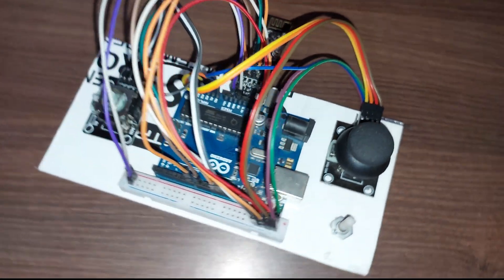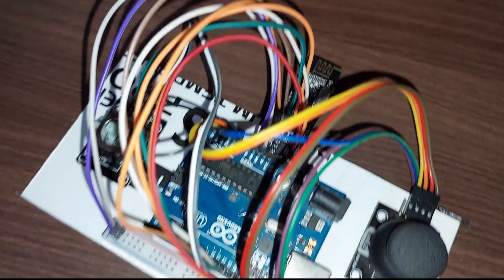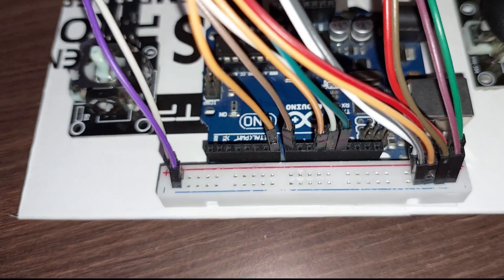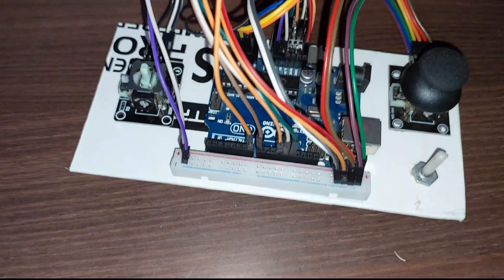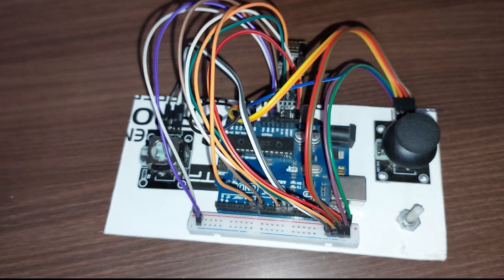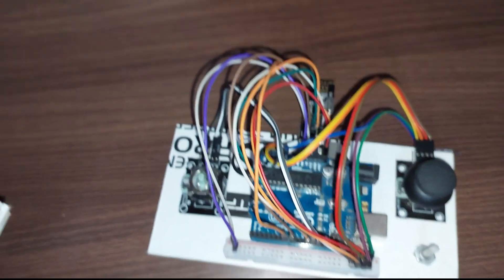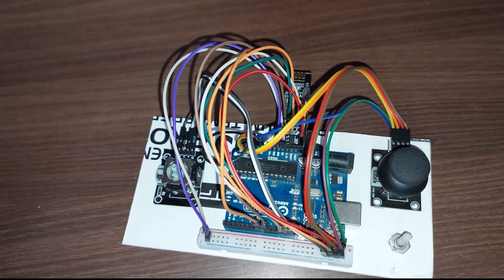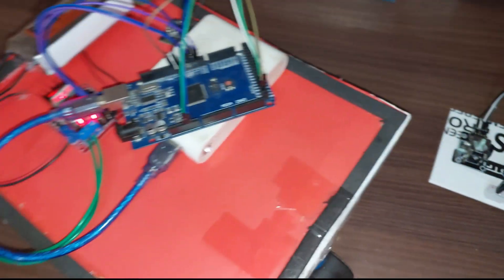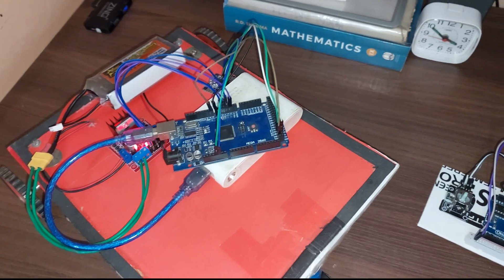On the transmitter side, you do not need much at all — just an Arduino and an NRF module. Connect pins 7 and 8 as CE and CSN respectively for best reliability, and your standard SPI outputs. I decided to just reuse the entire existing build rather than removing the Arduinos and NRFs and rewiring everything. That's basically it for the physical wiring of the robot.